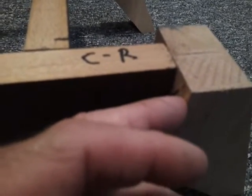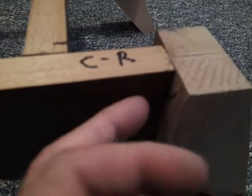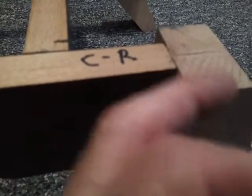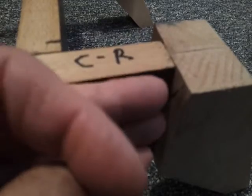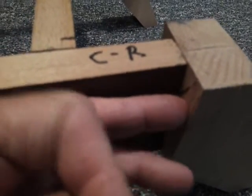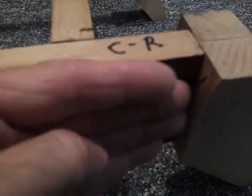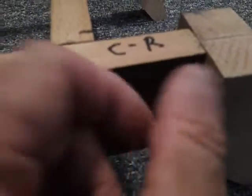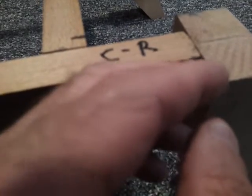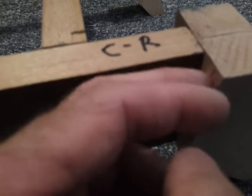But make sure you don't fill up the bottom of the hole too much, because when you go to hammer the dowel rod in, you should be able to see the bottom through the glue. If there's too much glue, then your dowel won't go all the way in. Potentially it could, but because the glue has nowhere to go, it'll act the same as if it was a piece of wood stuck in there. Of course the dowel rods are fluted, so hopefully any glue that might get trapped could come out there. But I would just make sure you don't overfill the hole.